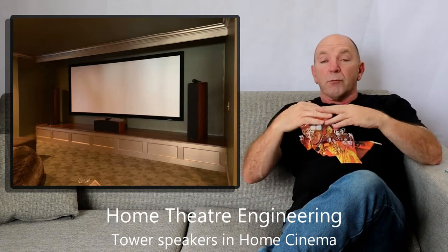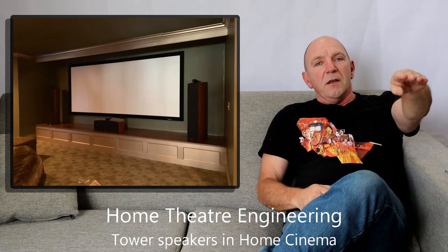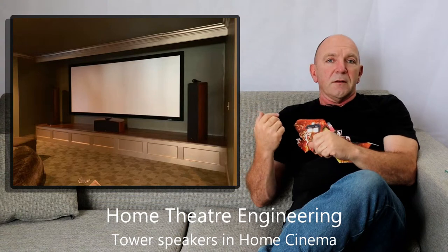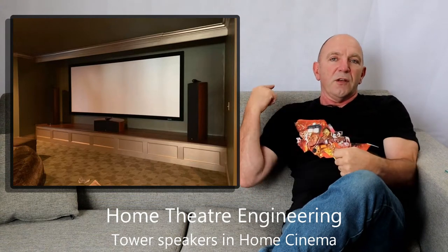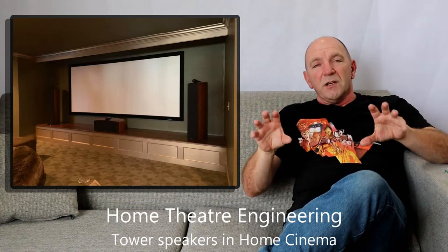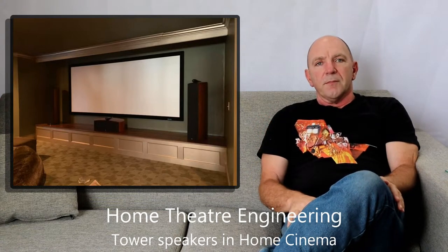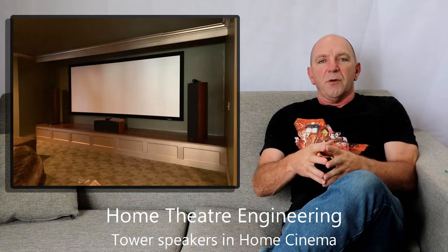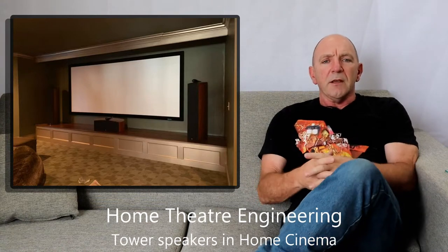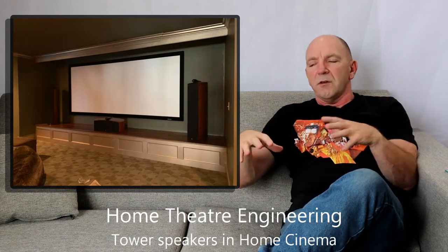If you have a riser or two tiers of seats then you have to compromise at some point, but I would suggest the speakers need to be slightly higher so that sound can reach the people behind without being blocked by the heads in front. If the speakers are too low and beam upward, someone is going to miss out. If you come up, there's a chance you can deliver clear sound within reason to all seats, bearing in mind that the beam spread of high frequencies is not as broad as it is at lower frequencies. So you have to work harder to create a better sweet spot — that's something the Home Acoustic Alliance works on very hard. Once your left and right are sorted with heights adjusted and tweeters pointed at the predominant seating positions, what about the centre?